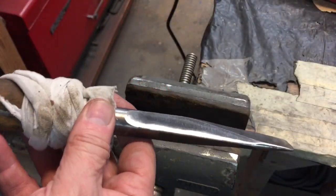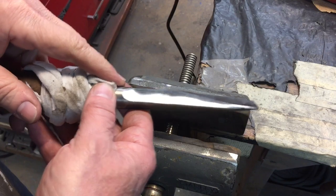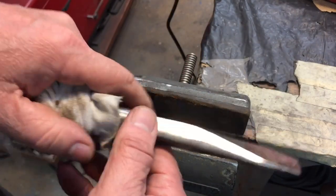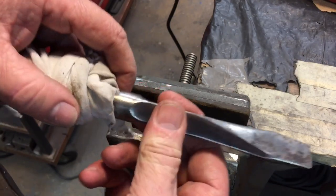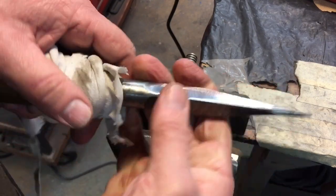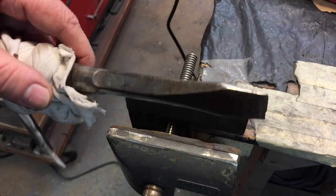Two more important things: you should get one of these clamp lights. I can adjust this light to get it right where I need it. You want to see clearly when this is in the vise — if it's dark you can't see where you're hitting or not, but with a good light you can see exactly where the disc is making contact. So a clamp light is a really good thing over your work area. Second, even though this is a thick piece of metal, it does get hot when you're using a grinding or flapper disc. After every facet, dip it in cold water until it's room temperature again before you continue. Don't wait till it gets too hot because then you might ruin the temper — the thinner the metal, the more susceptible it is to heat.